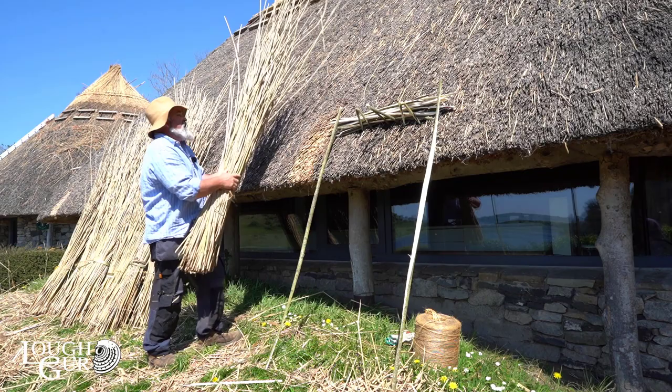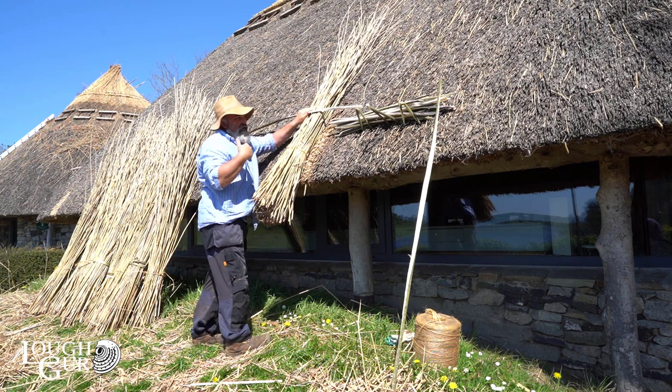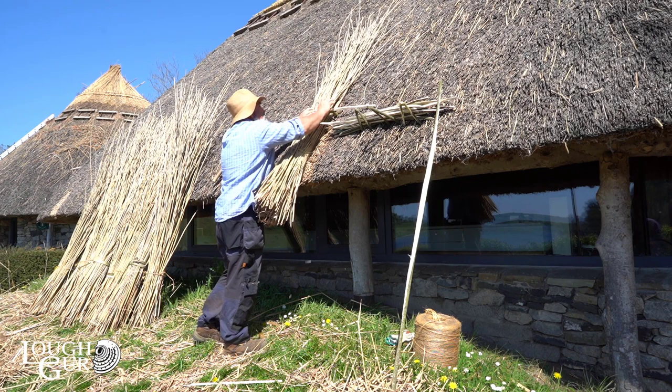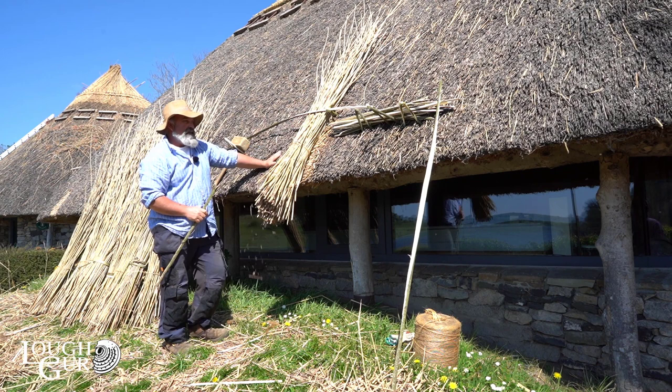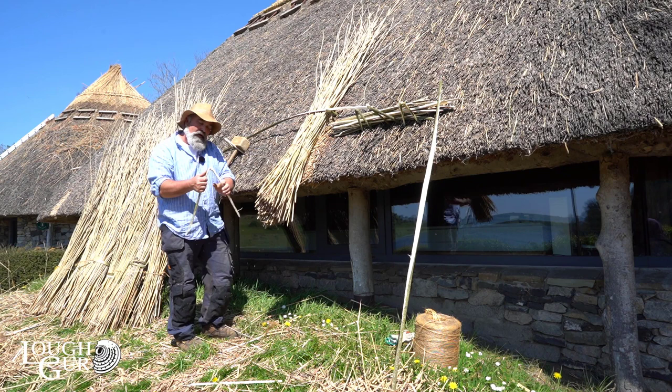The reed we harvested yesterday is exceptionally rough because it was the first time it was cut. The early settlers here would have searched around the reed bed looking for the best reed they could find. Once reed has been harvested for a couple of years it grows straighter and finer and becomes more workable. To fix reed on a roof — whether repairing an existing thatched roof or attaching a new one — you lash it to the timber framework, then thatch on top. Quite often you'd use sod cut from nearby bog, laid straight on your rafter branches, to give something you can drive the scallops into.